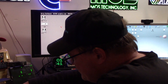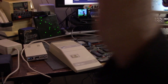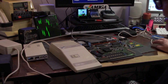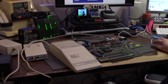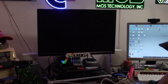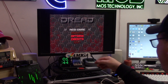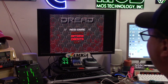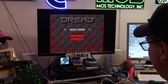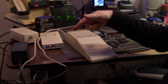So this dead motherboard is now a functional Amiga. Can we run a game? Can we run Dread? Let's try it. The cool thing with this GVP — I can go like this, turn it off, hit the game switch, this prevents auto-boot, and now I will have full floppy access and I can boot off DF1 and load Dread. There you go — awesome! Off of GoTek. Busted Amiga. I have no keyboard, but Dread — GVP, GoTek — now a revived Amiga 500 Rev5.